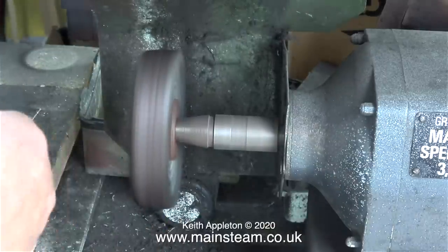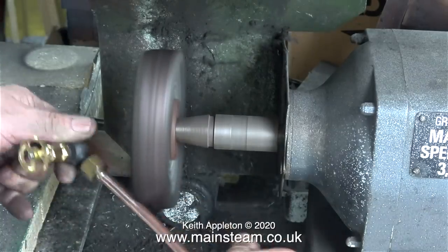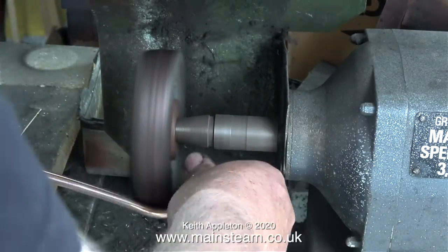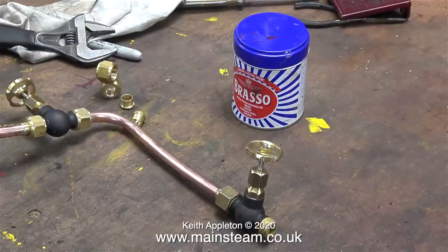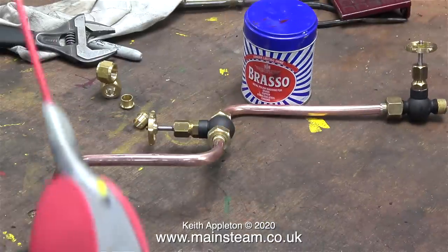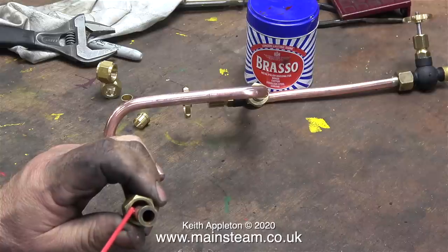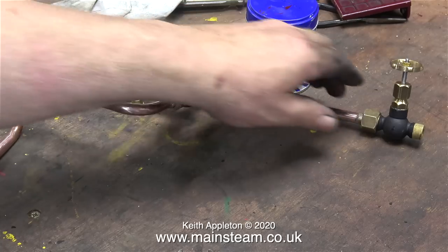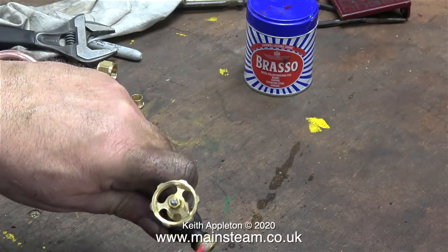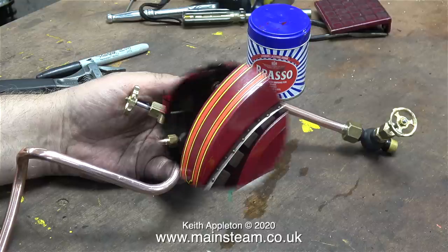Sharing the same bench as the brazing hearth is my polishing spindle, which makes it very easy to clean piping immediately after I've quenched it in the water pot. Behind the polishing spindle I didn't bother with the acid bath on this job — I thought I'd do it the hard way. The end result is about the same though; the pipe is nice and clean. And what's the WD-40 for? Well, I'm taking no chances — I want to make sure that the thread on the union nut and the thread on the globe valve at the other end smoothly engage what they are connected to, so hopefully I'll be able to turn the union nuts with my fingers, rather than incrementally with a spanner.